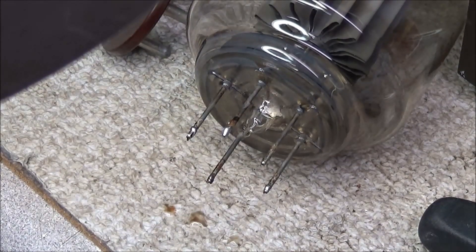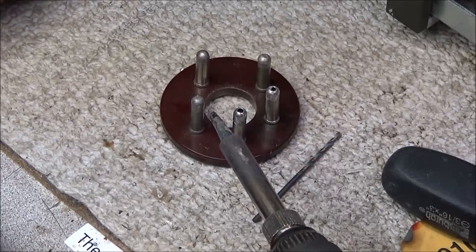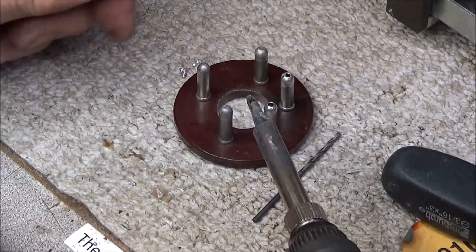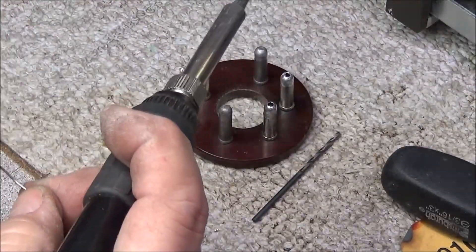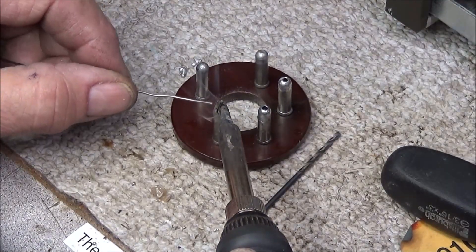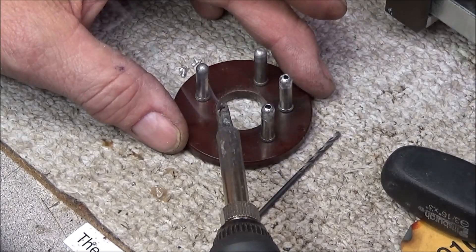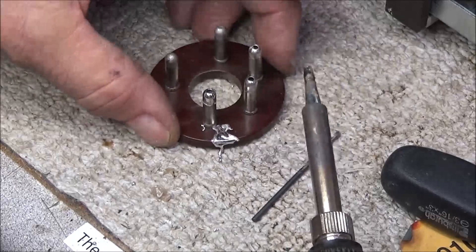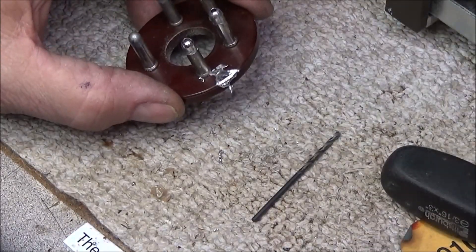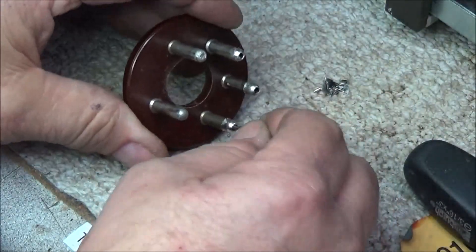I've got the flux cleaned off and we've got some nice pretty clean tube pins. A lot of times to get the old solder out of the tube pin terminal, you don't want to heat it so much that you start burning the phenolic material. You can just get a little solder on your iron in there so it gets good heat transfer, let it heat up the end of the pin, then just give it a good slap on the table. Yeah, there's solder everywhere but it comes right off. Then with a little fine drill bit you just go through to push out anything that's still in there.